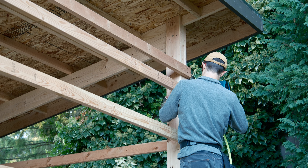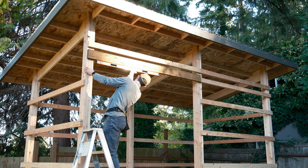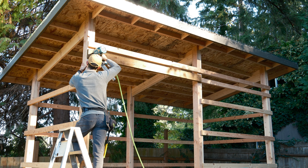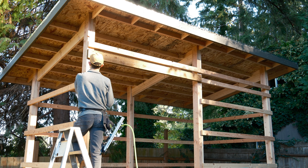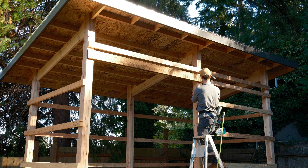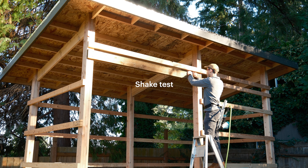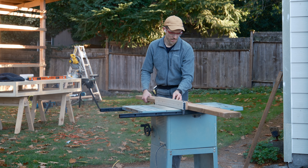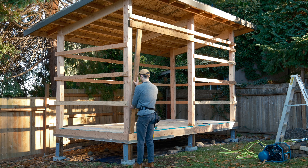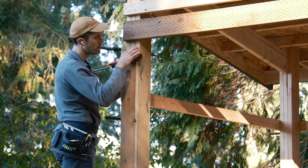With the galvanized steel skirt in place, the only thing left to do before house wrap was to finish up some framing. The girt placement here is a little bit odd being so close to the ones above them, but that's because I decided to move the siding down in my plan a little bit to completely cover the rim joist. Doing that meant the tops of my siding panels were now landing a little bit lower, and I needed some nailing surface to attach them. I also decided to use a 2x6 for my door header here, but luckily I had this piece left over from the garden bed build. That's why this and the next two pieces are randomly pressure treated. I ripped this 2x6 down to four and a half inches to give me some material to pack out the door frame. This material flushes up the door jamb with the rest of the girts and gives me some solid material to attach door hinges to later. It was a little bit warped so I just flushed it up with a clamp before attaching it fully.